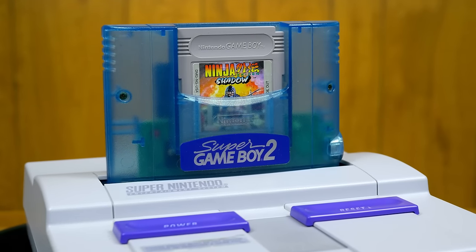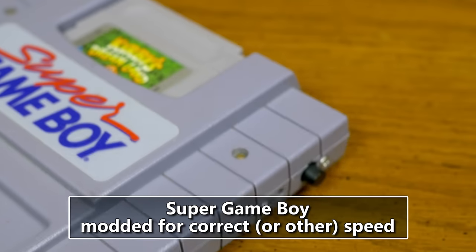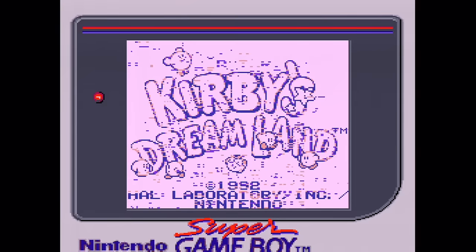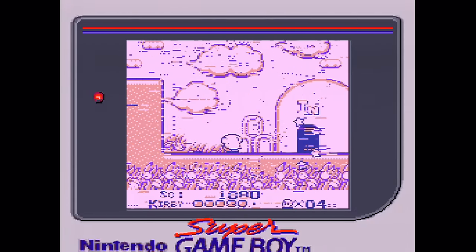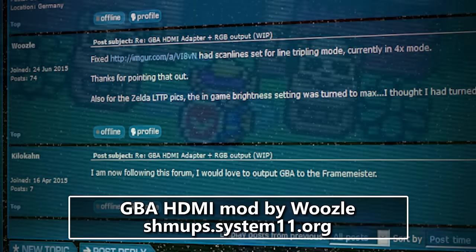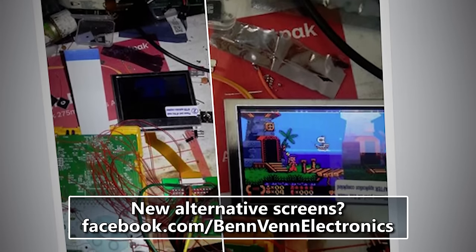One last mod: if you don't want to buy a Super Game Boy 2, it's actually possible to inexpensively install a Crystal Oscillator in a Super Game Boy so that it runs at the correct speed. The unit we tested actually has a dial for seriously underclocking or overclocking the Super Game Boy for some pretty weird results. We've also heard about a few things that aren't ready just yet, like a GBA HDMI mod by ShmupsForums member Woozle, as well as some R&D for total screen replacements. We hope to cover options like these in the RGB 300 series as they become available.